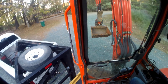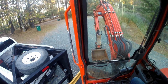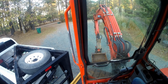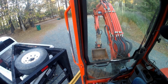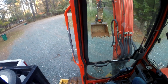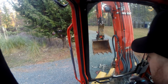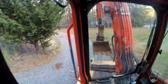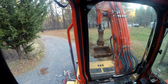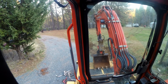So all you got to do, it is not ideal, but put that bucket down in there in the dirt, lift up the track just a little bit. Doesn't take much. Definitely got to make sure you're not underneath any power lines. Keep your blade even. I got a spot down there for it. Then we just go ahead. Be good. Okay,